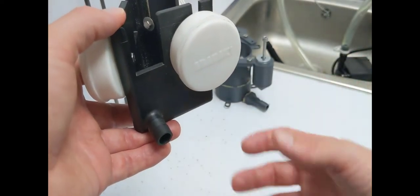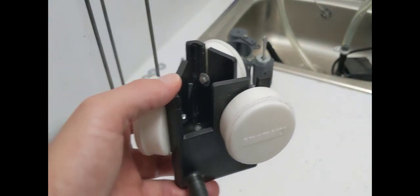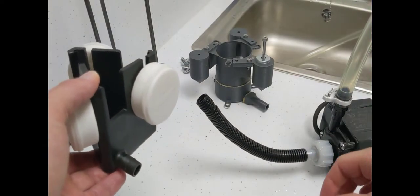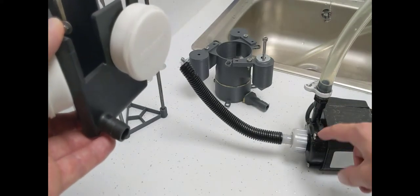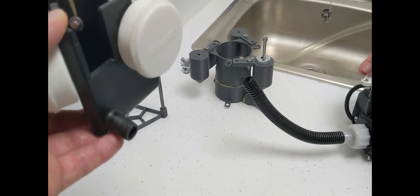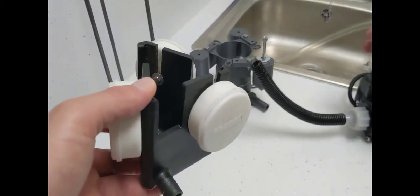If you have a pump just sucking the coolant up and putting it through a filter, unless it's drawing from the surface it won't catch the floating debris. Here's a normal fish tank pump — it has a little impeller inside and takes coolant up to the filter. There's a filter and a coalescer, similar to how a pond pump works: it filters up into a tank where it settles, the oil rises to the top, gets isolated in that tank, and doesn't go back around your coolant tank.